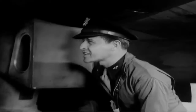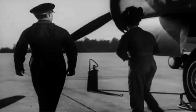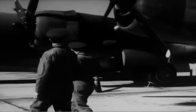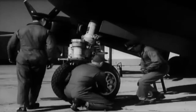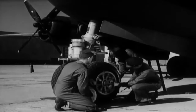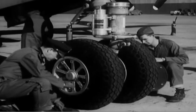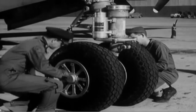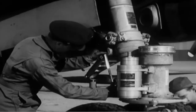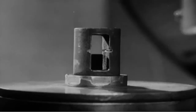Here's the B-29 pilot. He's measuring the distance between pin centers on the left landing gear. This part of the job isn't so glamorous, but it's the pilot's responsibility to make sure that everything on this biggest bomber in the world works properly. If you were a B-29 pilot, here's exactly what you'd have to do before an operational flight. Check the nose wheel. See that the tires are inflated to 45 to 50 pounds per square inch. While measuring the pressure, look over the tires for general condition also. Watch out especially for cuts or signs of serious wear. The shimmy damper must be full — make sure the rod is almost up to the notch in the gauge on the shimmy damper reservoir.